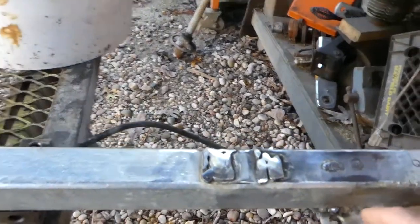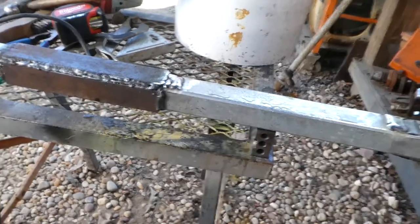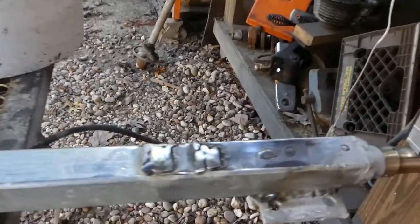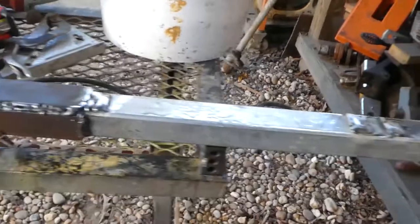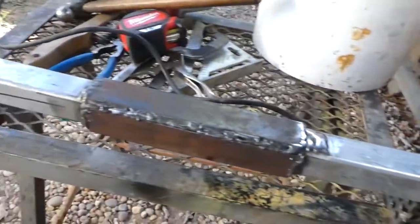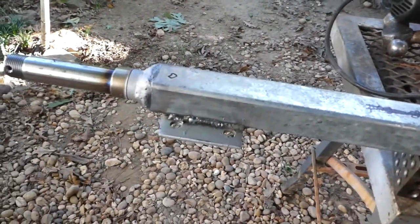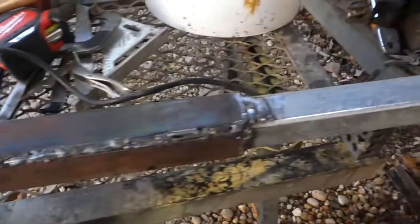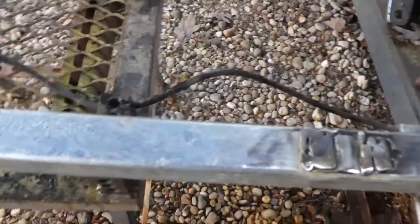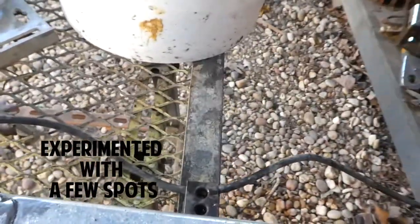The plates actually made the bow a little bit worse. I ended up trying a heat method, but when I went to get my acetylene torch, my tank was down to about 25 psi and it just spits and spurts at that level. So I went ahead and did some flat welds on top of the bar to heat it up and then quenched it with some water, which got me the last little bit out.